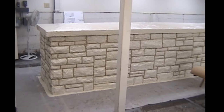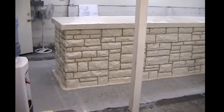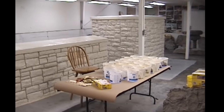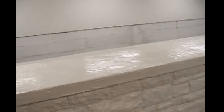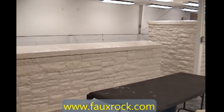In the joints, because the joints were so deep, I didn't want the rubber to have all these catches in the hard mold, so I put liquid nails in the joints because I didn't think I had enough rubber, let it dry, and then encapsulated over it. Here I've used silicone. I don't care what I'm throwing in there, I'm just filling that joint, all the joints, to get the rubber to be more of a smooth outer profile that doesn't have catches that the hard mold will get into. So here we've got the last coat of rubber all on. Next day, we're going to start the hard molds.